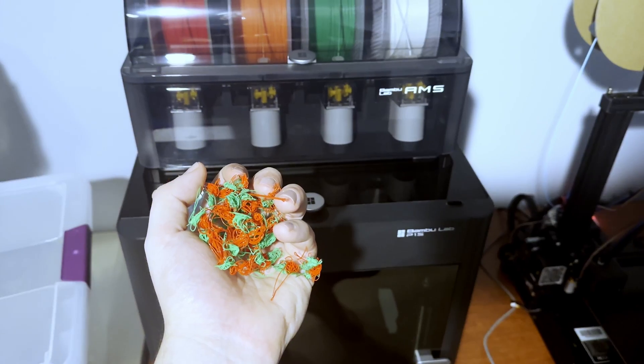It's been a few days — I've printed various things on this AMS system and here are my final thoughts. If you want to print sculptures and different art pieces in a variety of colors, then you're going to need an AMS. Just keep in mind every time you're swapping filament, you're wasting too. Things like the frog or the keychain take significantly longer to print because of all the time spent swapping filaments and making the purge tower. I can't say for certain whether the support material for PLA is worth it — I used it on this microwave handle and it left a rough texture on the bottom. I've seen similar results just using normal tree supports with a normal Z support distance. But if you need that material, then you have to use an AMS as well.